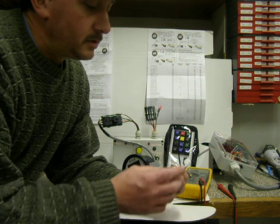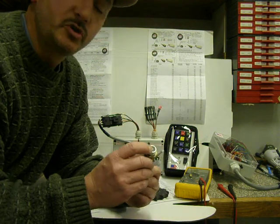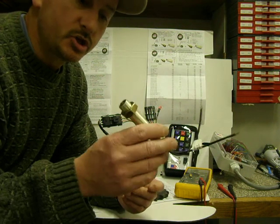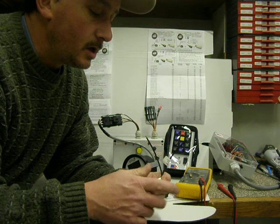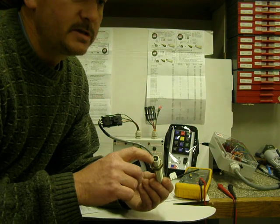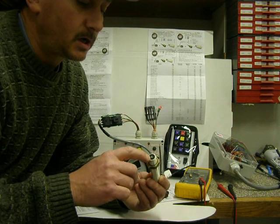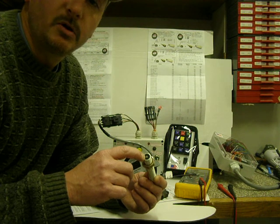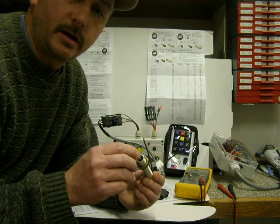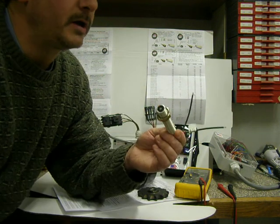The main problem is either they get out of calibration — too far away. They're supposed to be within 10 or 20 thousandths away; you'll have to look in the data sheets. Every time you start the engine, little metal fragments happen. These magnetic pickups seem to pick up those fragments inside of that bell housing, and once it gets contaminated with enough of those little fragments, it can't read out or it shorts the point out.